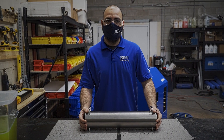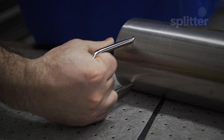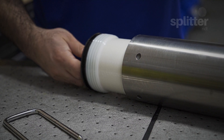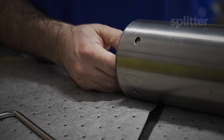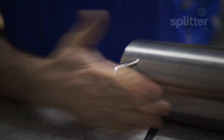To improve performance and serviceability the next major change is in the membranes and membrane housing. We have streamlined our product offering to two models that process 200 and 400 gallons per day respectively. The membrane housings are now made of stainless steel and configured horizontally instead of vertically. We changed the dimensions, structure, and construction of the membranes themselves to improve the efficiency and longevity of the membranes.